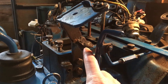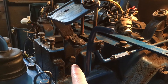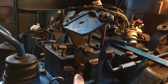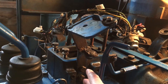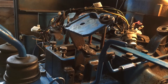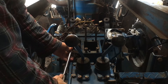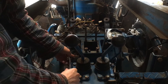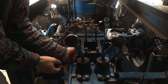Here is the other side of the rubber grommet. This bracket supports the hand throttle and bolts onto the housing next to the steering column, and there's another one on the other side. These two are going to come off the tractor and I'll assemble them into the dash so that when the new steering column goes in, I can slide the dash down and just put in those two bolts below. That should make reassembly go faster. It's 17 millimeters on the socket — the other side is already loose from the hand throttle removal.